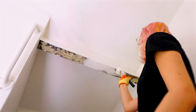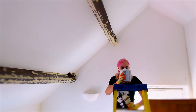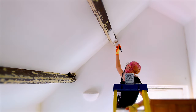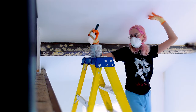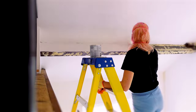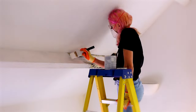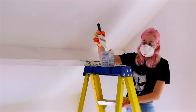The next step was using a ton of wood filler to fill every single hole and crack. And now unfortunately that leaves us with the only option to paint the beams white and then add a wax on top. We're doing all of this to try and restore the beams, to try and prevent the beetles doing more damage and the splits from getting worse. Hopefully us moving in and heating the house will naturally prevent this too. We also wanted to make the beams lighter — I am not a huge fan of that dark red wooden look. It's in the old flat and I covered it with vinyl. About 15 years ago it would have been fashionable but now I just feel like it's a really dated look and it does make the room look darker. Our aim is to bring the light into these rooms and have some lovely light wooden beams, if that's possible.